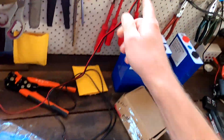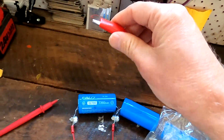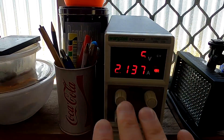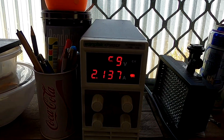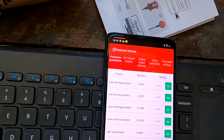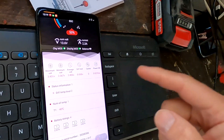The next step is to turn on the power supply at 14.3V, connect positive to positive and negative to the BMS. It is charging — 2.1A. Cell voltage high protection is set to 3.65V, so when the first cell reaches 3.65V it will cut off. So I can leave this running and the BMS should turn off at 3.65V. Above 3.5V it should also start balancing with 20mV deviation.